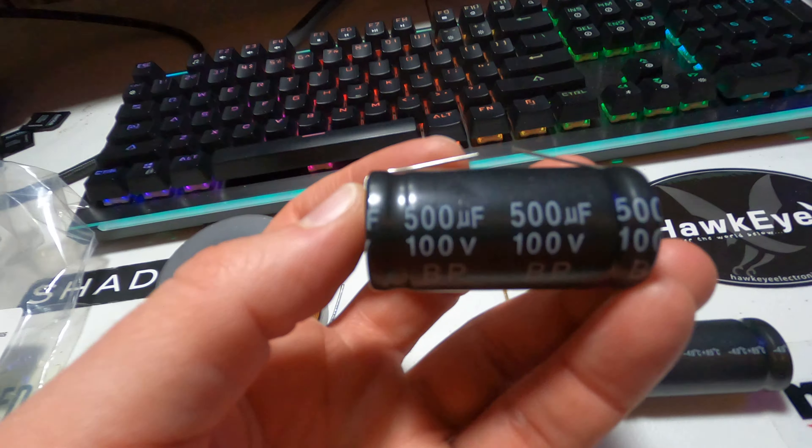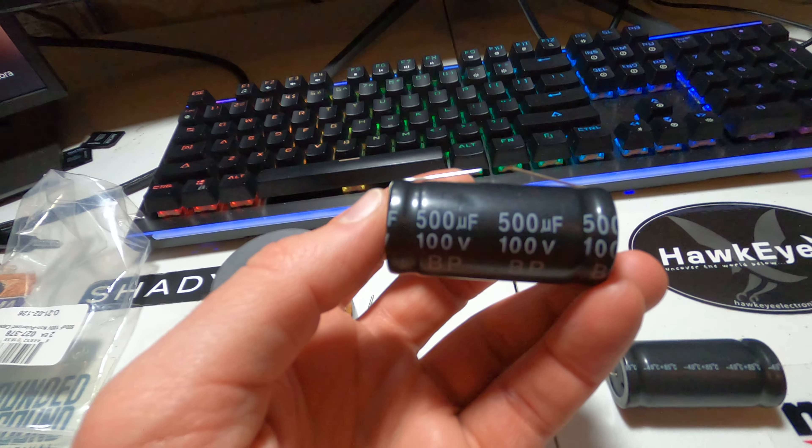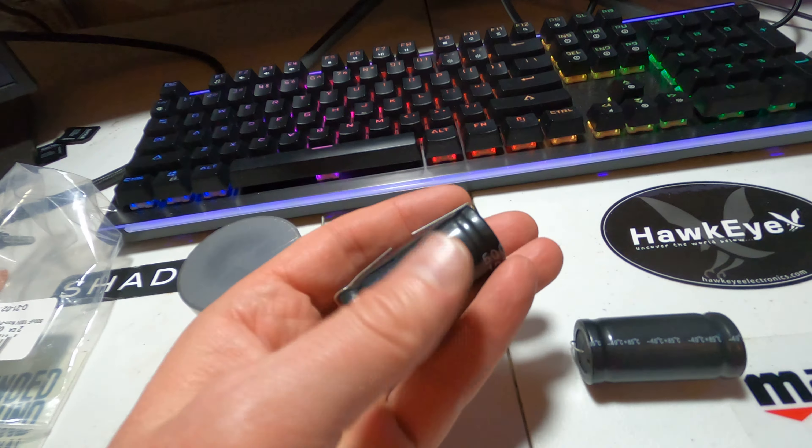To do that, as you can see, we've got a capacitor here, a capacitor here, and an inductor here that leads right to the subwoofer. I looked at the chart and decided I wanted my cutoff frequency — the frequency that separates which signal goes to which speaker — to be at 100 Hz.